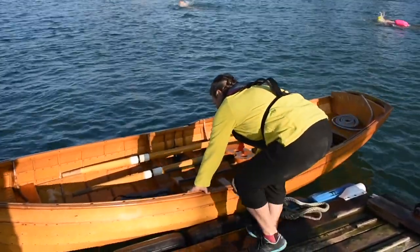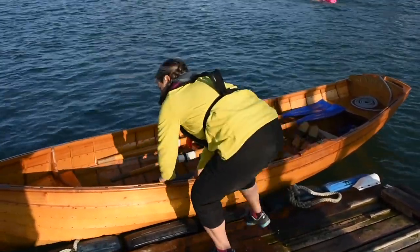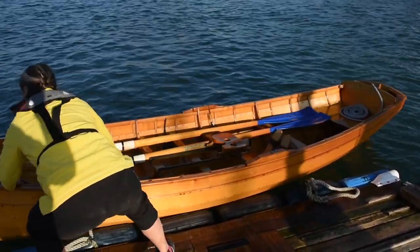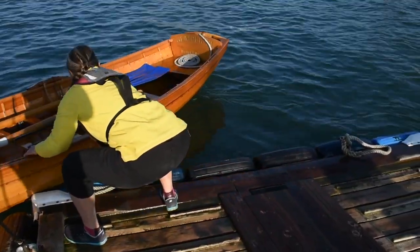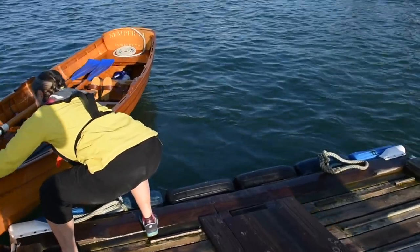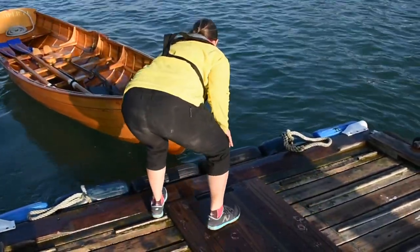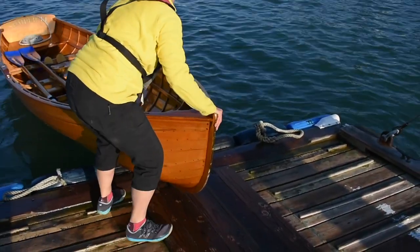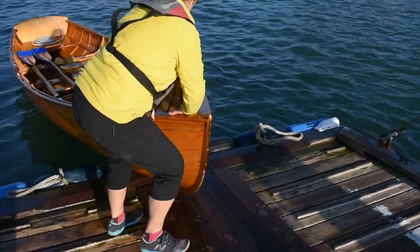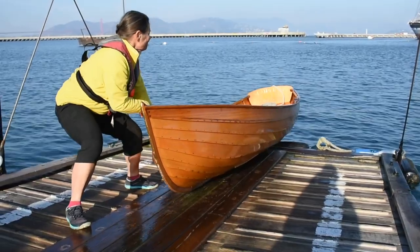Just like when you launch the boat, you can use the corner of the apron to pivot the boat into the recovery position. First, bring the bow past the left-hand side of the dock, then push out the beam until the boat is close to perpendicular. Pull the bow to the center where the roller is. Lift with your legs and in one motion, lift the bow and pull the boat onto the ramp. Slide the boat up so at least two-thirds of the boat is on the ramp. Tie the bow line off to a cleat.